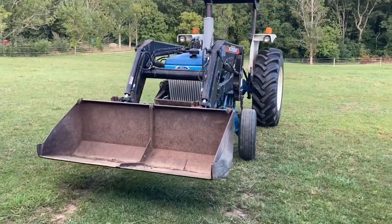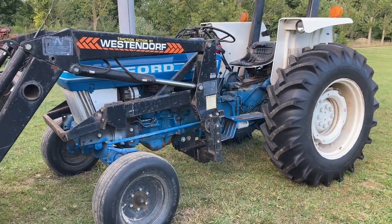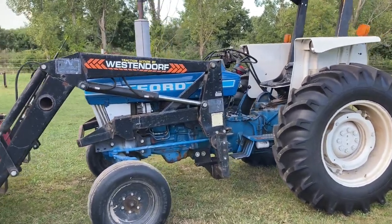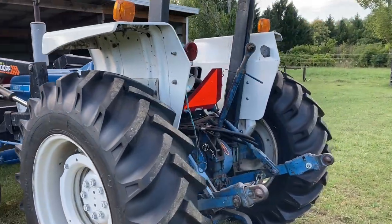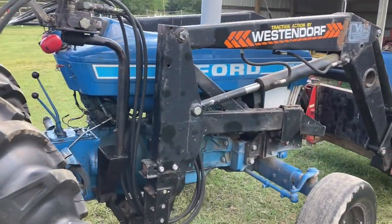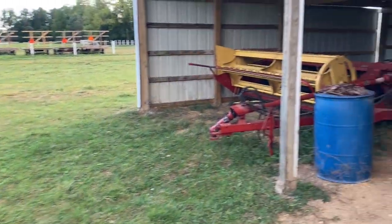The essential — you need to have a tractor. This is my trusty Ford 4610, it is 63 horsepower overall, around 52 horsepower at the PTO. I have a video review on it — I'll see if I can figure out how to post that link somewhere. This is a great all-around square baling tractor for a small hay operation. It has two hydraulic remotes on the back to run hydraulics for implements, and it does have a quick-detach loader that I take off when I'm making hay.